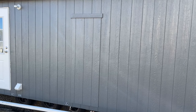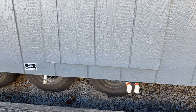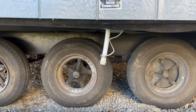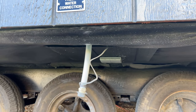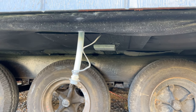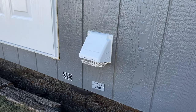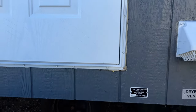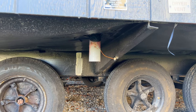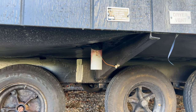Right here we have our water heater access panel. Right below is going to be your drains for the water heater. Right next to that is going to be your freshwater connection — this house comes standard with all PEX. And right back in the back, you're going to see an electrical receptacle so that you can plug in heat tape to protect your pipes in the winter months. Here you're going to notice your dryer vent. Right next to that is where your electrical is going to come in — this house has a 100-amp service. That's where your electrician is going to put the electrical wire into the home and tie into the breaker box.